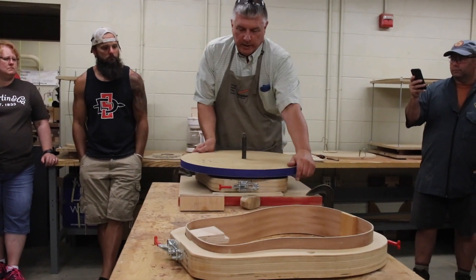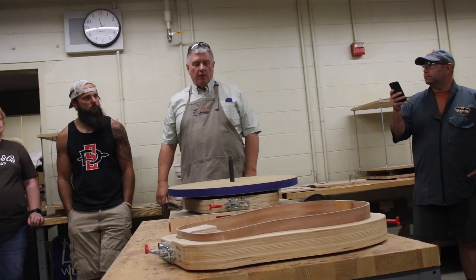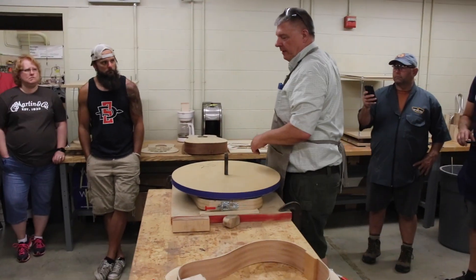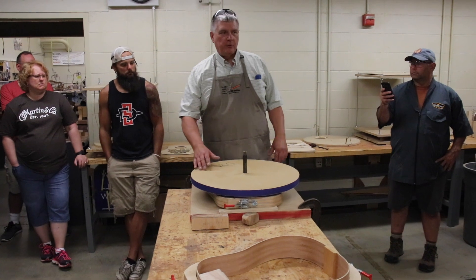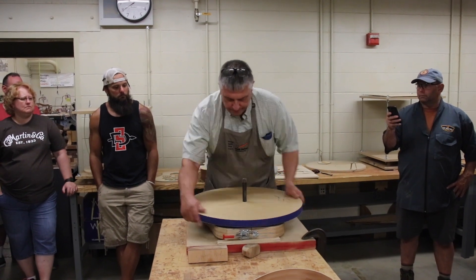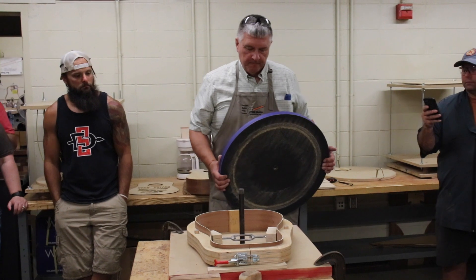Then about 20 times the other way to even it out. If you had a perfect setup you'd have just a square here and walk around to do the other side. But you can go a little heavy on one side and put too much pressure, making one side a little thinner than the other — so that's why I like the back-and-forth. You can also see on the abrasive paper where it's actually making contact.